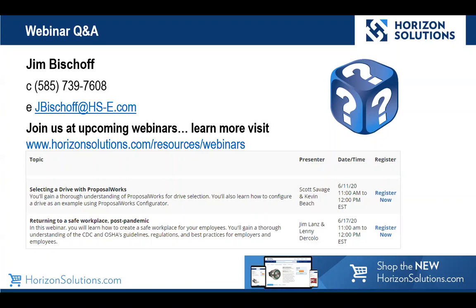Thanks for that answer. I think we just have one more question, unless anybody else chimes in shortly. If I don't have Ethernet on the machine, can I still use GuardLink? You can. You would get the benefits of the visual indicators that you get on the taps. However, you cannot do the remote lock, unlock, reset commands. Those do require the Ethernet interface to a logic controller.